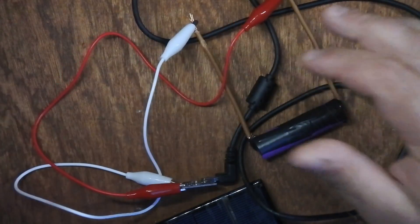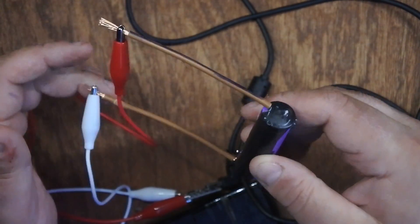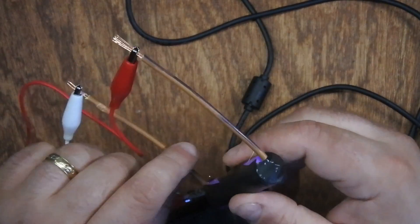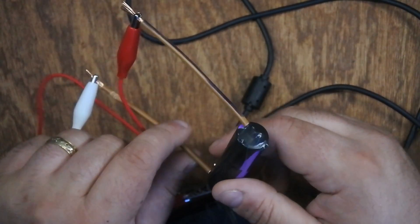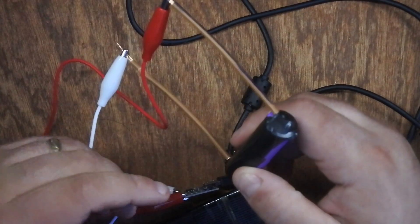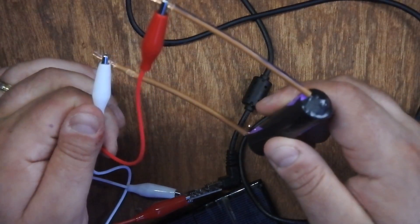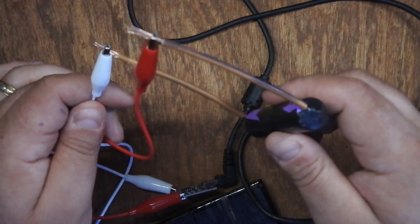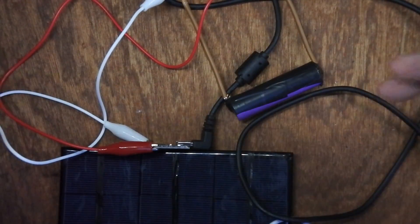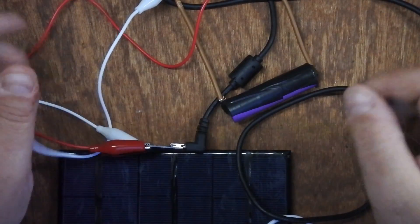Because the ultimate aim would be to have multiple batteries. This is a 1800 milliamp hour battery. I would probably work with 2000 milliamp hour batteries — put five of them in and you've got 10,000 milliamp hours, which is more than enough to charge your phone possibly twice from fully flat. Bear in mind that USB power banks never give you full efficiency — you always lose 20 to 30% of the power in the charging process, so you'd really only get 70 or 80% of that power into your phone. But that's normal. It's a cheap way of building a power bank. Where I work, next to a very big glass window in the centre of Dublin, I'll plug it into this solar panel and take measurements every 15 minutes to see how much power is going into the battery. I'll see how it goes tomorrow — I'll be back for part two. Cheerio.